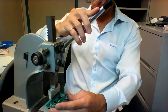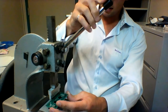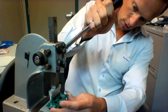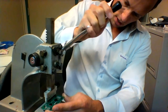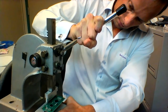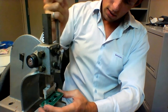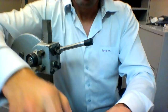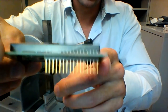Once the board is properly seated, hold one edge of the board so that there's no stress on the pins, and apply pressure on the handle until the pins are fully seated. It'll have a nice solid connection. As you can see, the pins are now fully seated.